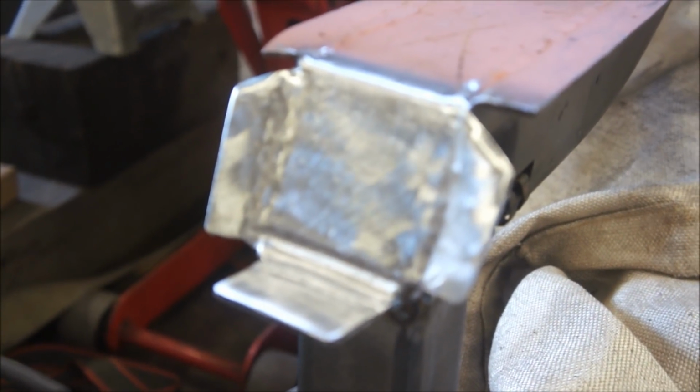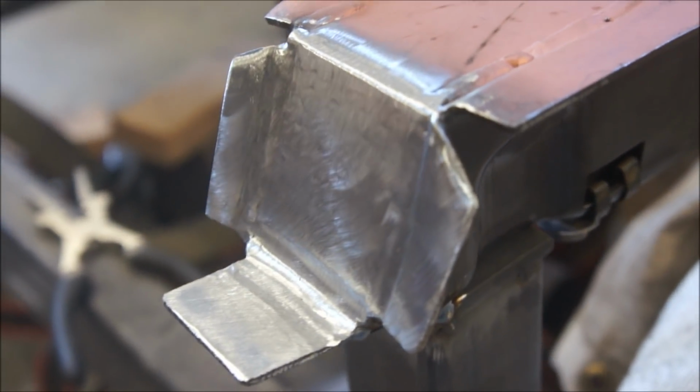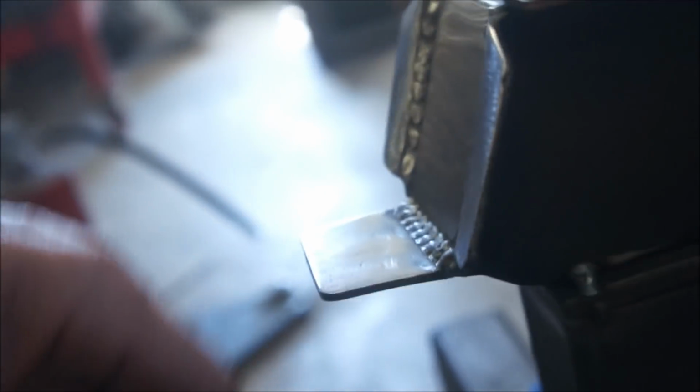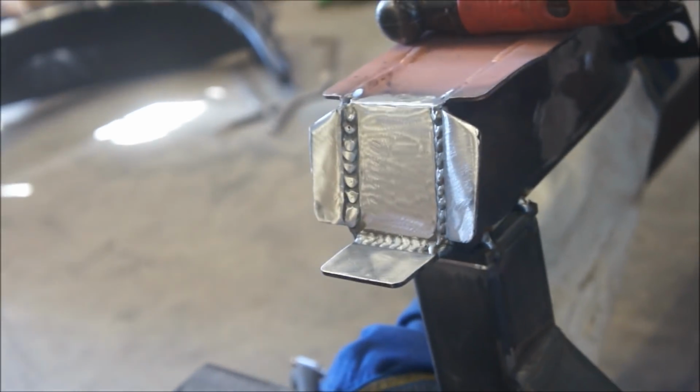All right, here's a done deal. Maybe it'll focus, maybe it won't. I left the back sandblasted, so what I'll do is run the nozzle up inside there and get all that from the inside. This side here I just left kind of ground off the tops, that way it wouldn't interfere here, but I didn't see any reason to keep on going down. I could have, but it's just more discs that I'm using. So I had done that one. I thought, you know what, I'll just leave that. My panel will go up against that, and so yeah, I like that, looks good.